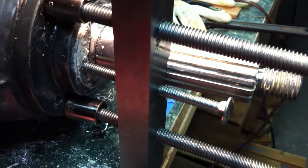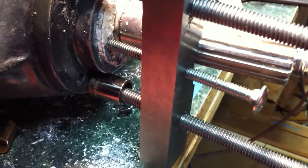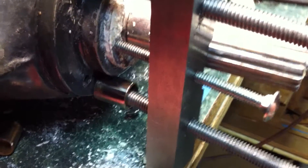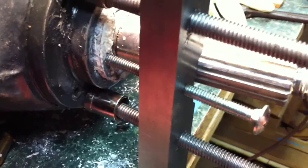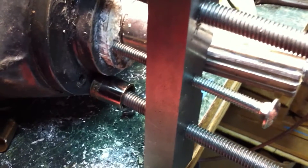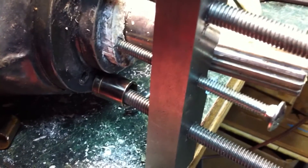Here we are winding out the last part of the zinc — you can see it's starting to move pretty easily now, and hopefully after a few more turns it'll be completely out. We may have to reposition, but that's okay. This is the puller, now on the third hole. I worked my way around tapping them and pulling on it a little bit. You can see it's coming out pretty good here, so I'm going to move the puller to the other side.